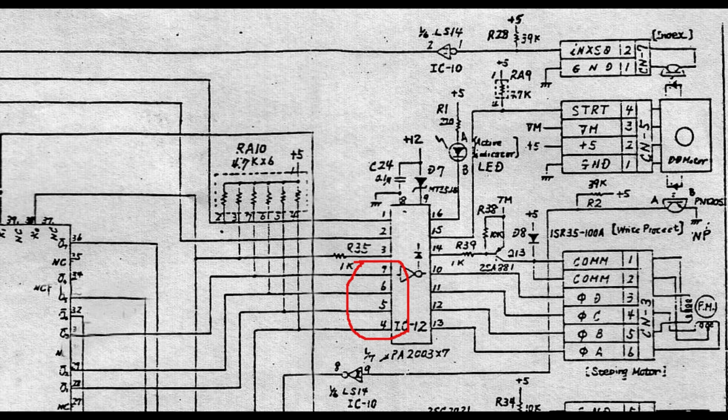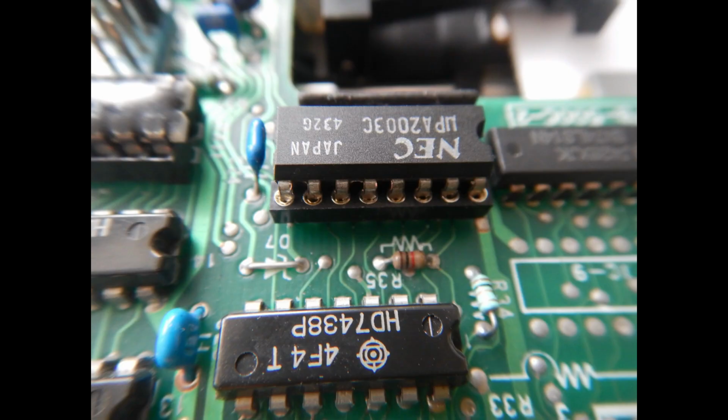Since I don't want to change too much on the drive firmware, I decided that I prefer bypassing the CPU entirely in this case, and drive the inputs of the IC that controls what phase wires get grounded. So the first modification I'll do on this drive is to add a socket on that IC. In this way, I can plug the original IC back into the socket and the drive will work normally with the Sugar interface. Or I can insert a little daughter board on this socket that isolates the input pins of the driver IC and brings them with a cable to the new controller electronics when I will have one.